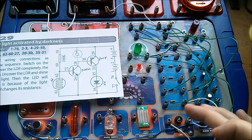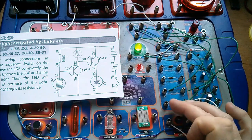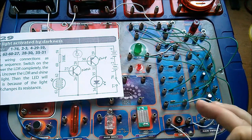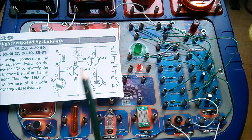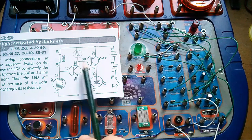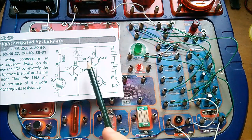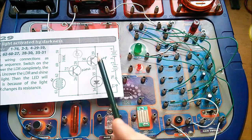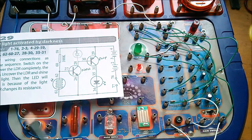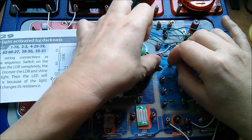I don't think it has affected the gain. It might possibly have changed the point at which the light-to-dark transition occurs — I can't quite think why that would be. 10k is a very high value resistor — 1k would be enough in there to protect these two transistors. With 1k and 6 volts, that would be 6 milliamps — both these transistors are going to be able to take 6 milliamps. Perhaps I'll move that to the 1k right now.